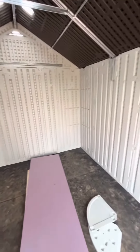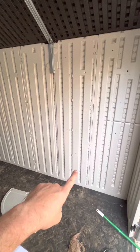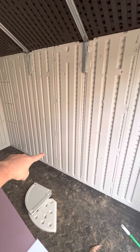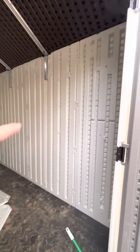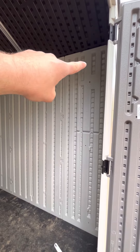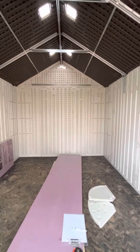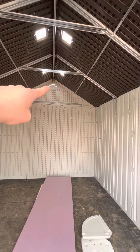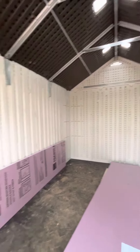Hopefully that'll be enough insulation for the chicks to keep them cool in the summer and warm in the winter. Once I get the framing up, I'll be cutting out somewhere over here — probably on this side — for the chicken run door, and put the automatic door in there. I'll mark and cut out where I'm gonna put some vents, drill some two and a half to three inch wide holes in each one of these panels all the way around to add more ventilation, because right now the only ventilation we have is at the top and one straight up on this roof piece here. But first I want to get it watertight.